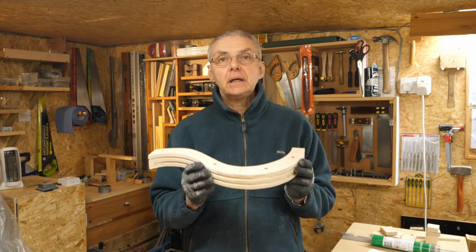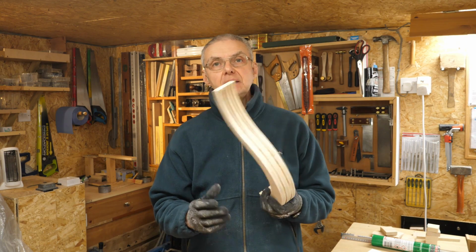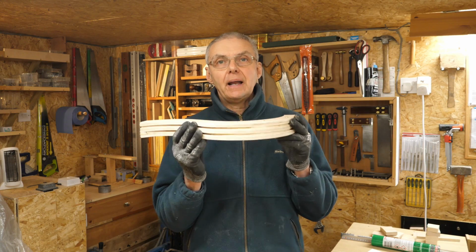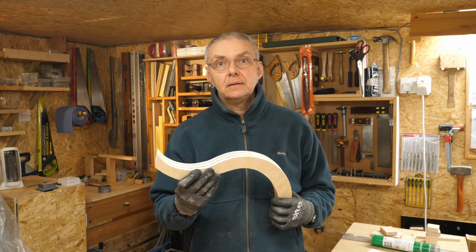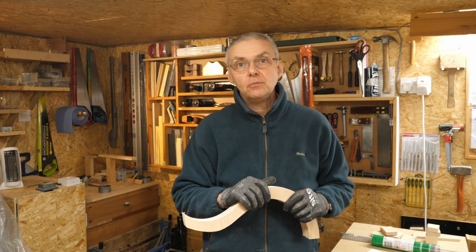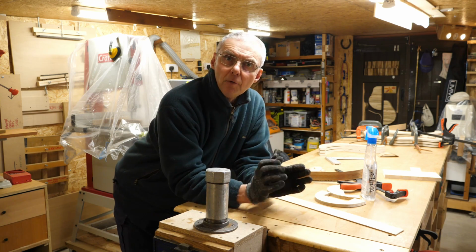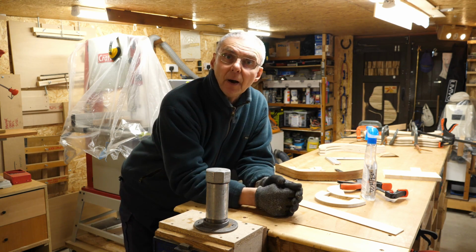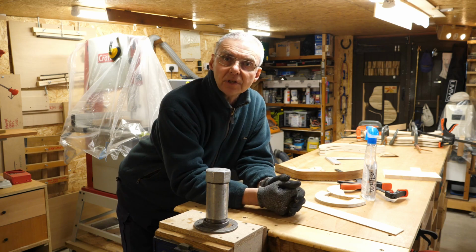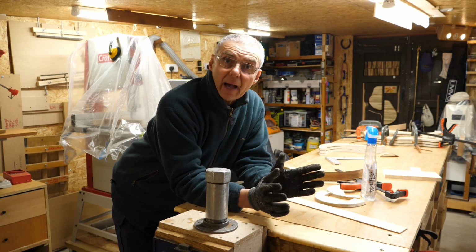I've also cut some clamping blocks out of the offcuts from the template so that I can clamp the bent wood into place once I've bent it. So I'm going to have a go at bending some wood. Now I'm using a homemade bending iron which I've made out of some galvanised pipe with some electronics in the box, and I'll put a link below to the video to show you how I made this thing.